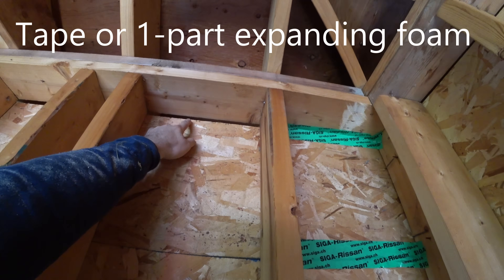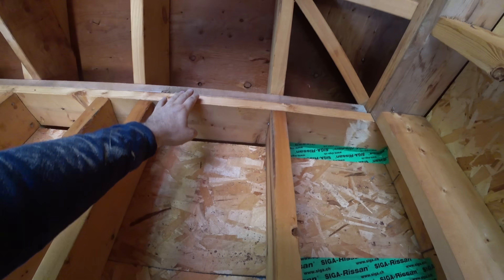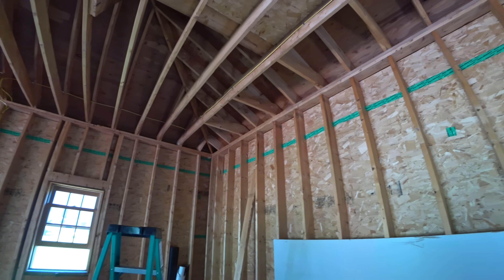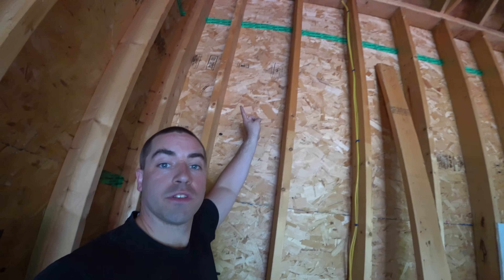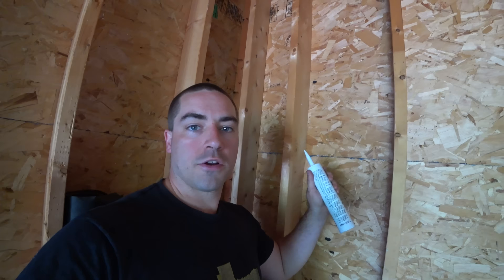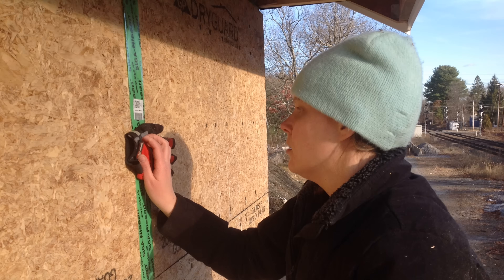I'm not a fan of this detail. I prefer when the framers lap onto the top plates — that helps lock everything down. Don't forget to air seal any holes left over from staging. After I've air sealed those sheathing joints, which tape works really well for, I'm now going to air seal the corners between the stud and the sheathing. For that, tape is not the best product — instead, I'm going to use polyurethane caulking because it can really get into those corners. It's a lot easier to air seal a structure from the outside. My favorite way is taping the sheathing joints on the exterior — I'll link a video in the description of how I did that on my own garage.